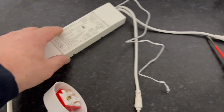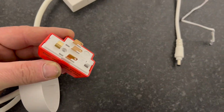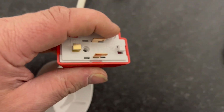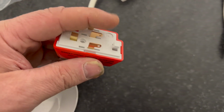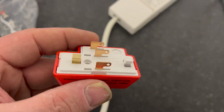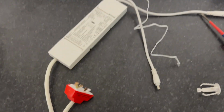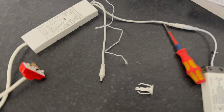It's mounted to the ceiling, and then this. So that plugs in, and that's what we're changing. And obviously, because that is the auxiliary bit there, the plug socket like I made on the last video with a standard plug, you just plug it in, so you can test it off this as well. So you can test the emergencies with a standard, but obviously it doesn't work the other way around because the emergency has 4 pin and the standard has 3, but all 3s can fit into 4s, but 4 pins can't fit into 3s. Common sense really, I suppose.